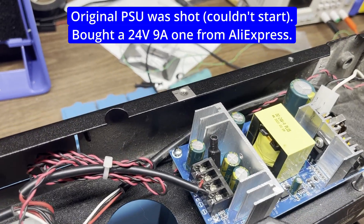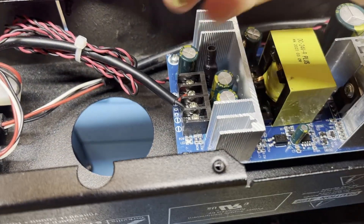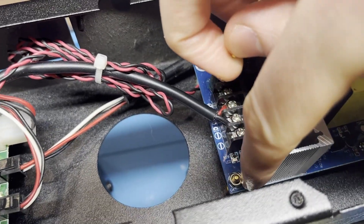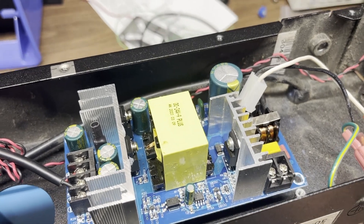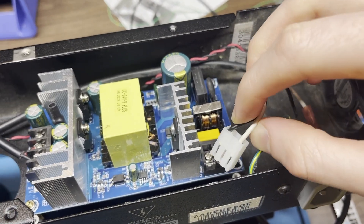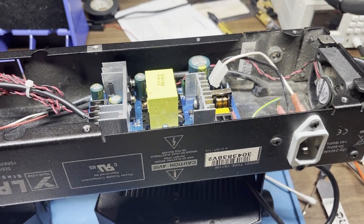For the power supply replacement I was able to reuse two of the existing standoffs, but the dimensions were not quite the same. So what I ended up doing was taking two standoffs from a little kit from the internet, screwing them into each other, and then feeding them through underneath. Now there's a little bit of flop here and that wouldn't be acceptable if this was moving, but it's just going to get set up in one spot and never move again so I think we can survive with that. I just have to snip these off and plug the black one into the L and then the white one into the N, box this guy up and call her close to fixed.